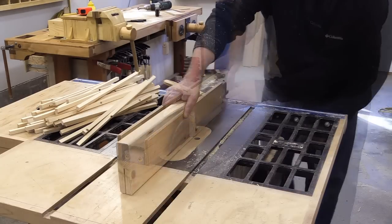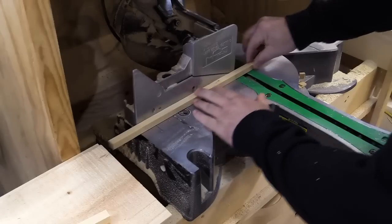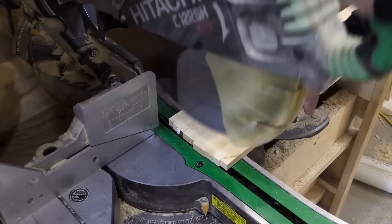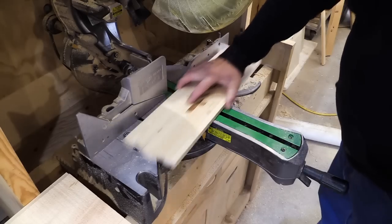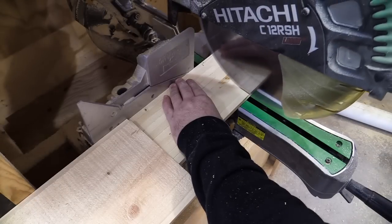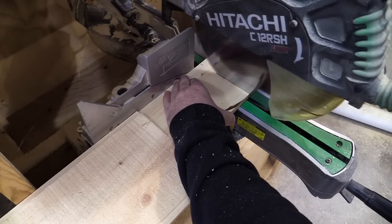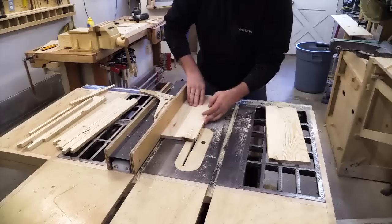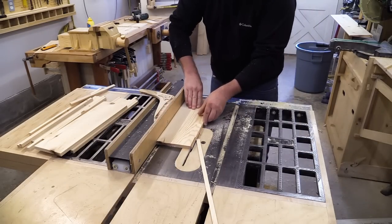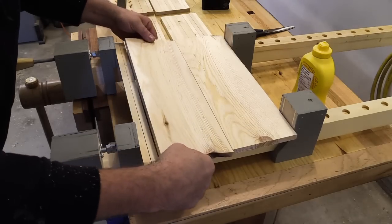Then I'm going to take the 2x6 and cut it down to a half inch thick. For the size of the box, I need to cut 10 pieces at 14 inches long and 10 more at 13 inches long. For the ends of the box, I need 10 that are 8 inches long and 10 that are 7 inches long. I need to make the bottom from the 2x6 pieces — I'll cut one edge off straight, then glue both pieces together using my new clamps.